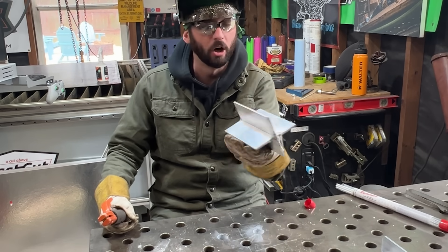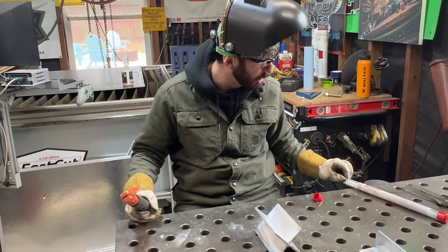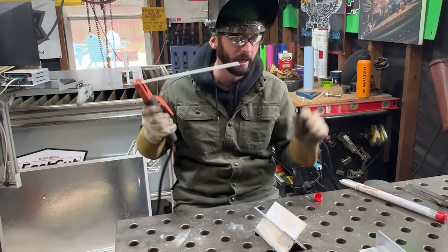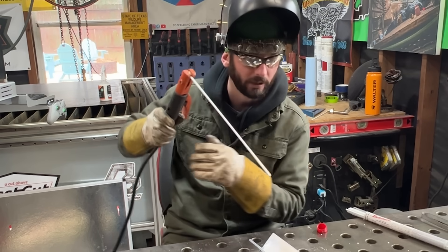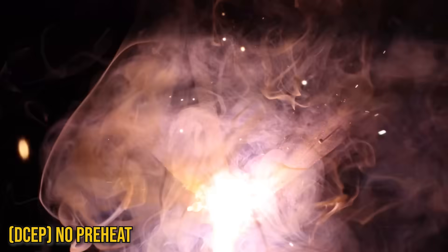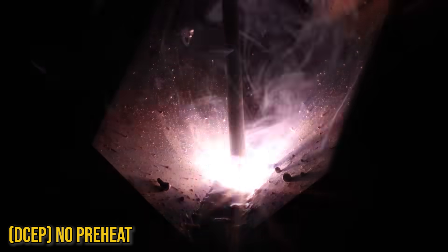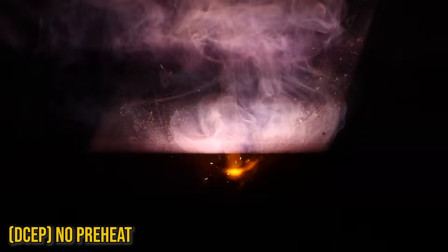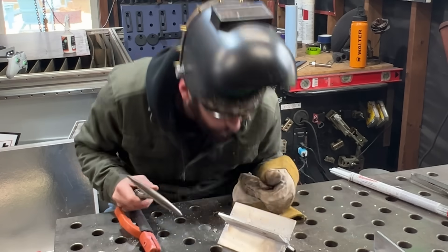This is where we're going to get all four of our welds — on this one and two more welds on this one. The first weld is going to be what I think is most people's problem when they attempt this: welding on aluminum completely cold. We've got to give it some preheat, but I am going to do a cold weld — no preheat at all — and just run this bead nice and flat. Then we'll cut the cross-sectional edge out and compare it to the one with preheat. Not bad. You can see this rod is just like stirring a bunch of molten glass around. There's so much action going on — the rod burns so quick.